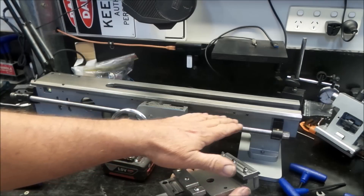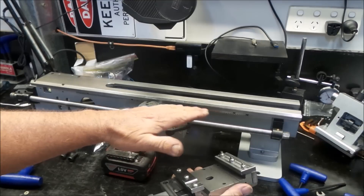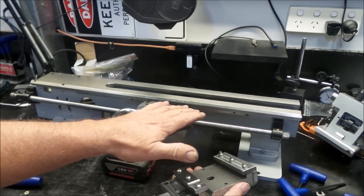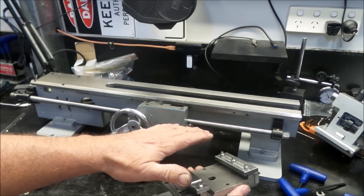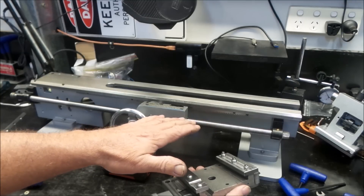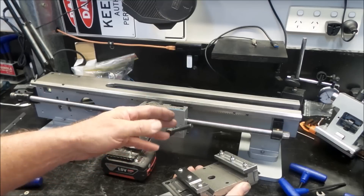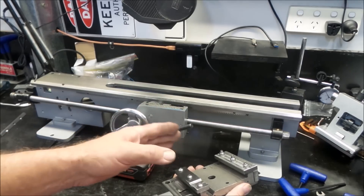The carriage rack mounted to the lathe bed also had to be moved again — back up to almost the original height, down about half a millimeter. I re-drilled and re-tapped it because two of the holes were misaligned from the factory, so I took the opportunity to redo them. Now we have good mesh between the rack and pinion and perfect alignment with the half nuts on the carriage lead screw. The lead screw is running perfectly parallel to the lathe bed — all misaligned areas sorted.